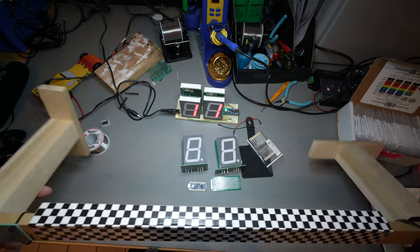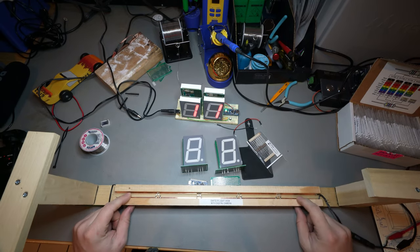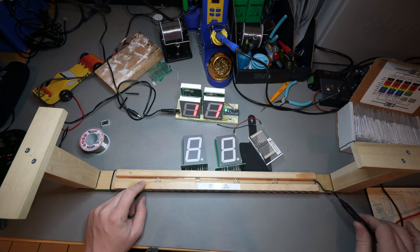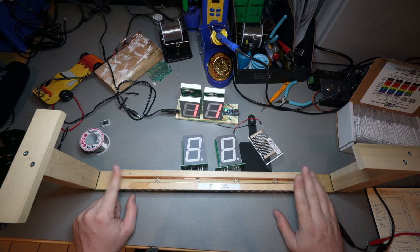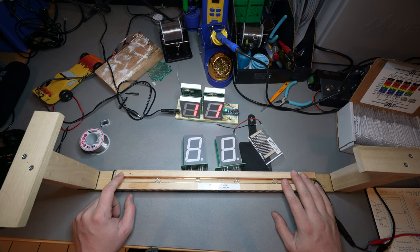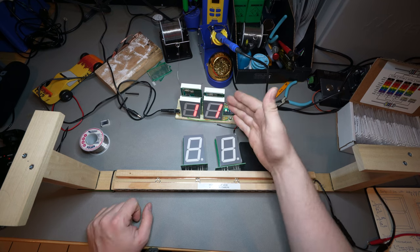But what I've just been doing today is trying to figure out this. So these are all the IR emitters down here in the bottom in this trough, and they're currently being powered on 3 volts, basically. And at 3 volts, this whole system takes half an amp, essentially, like 450 milliamps. And that's fine and dandy, but the thing is the displays need to run on 12 volts.